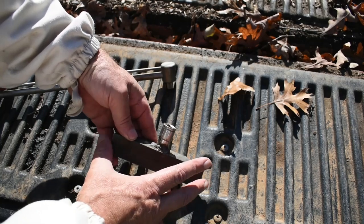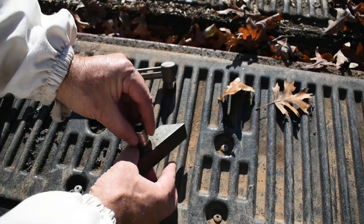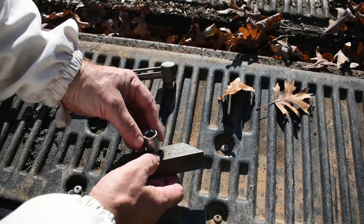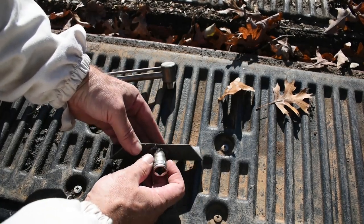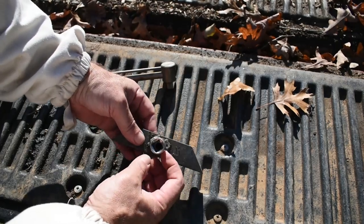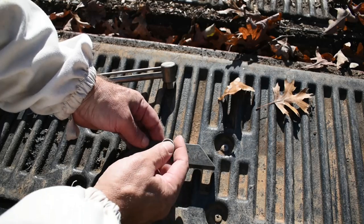It measures exactly six inches from sharp edge to sharp edge. The important thing if you want to make one of these yourself: don't use a chrome socket — use an impact socket, which will be non-chrome-plated. I had to grind the edge of that socket off before welding, or maybe I forgot, which is why I got such a rough weld.